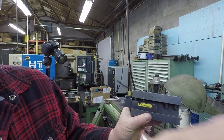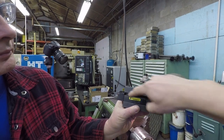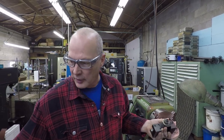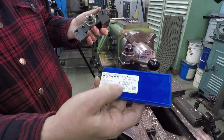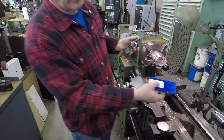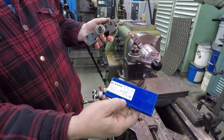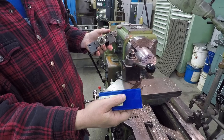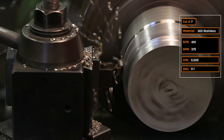With a negative insert you can literally see that downward angle. Not only do you get two sides — doubling your cutting edges — but you get a really strong overarm clamp that increases the holding power in the tool holder. This particular insert is made for roughing; the insert box has an R for roughing, then medium, then finish. It also shows interrupted, severe interrupted, and mild interrupted categories, as well as the materials it's rated for.